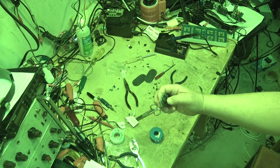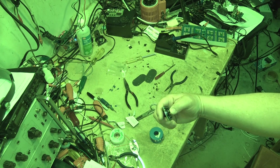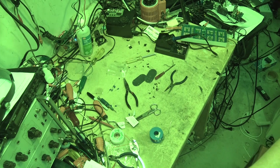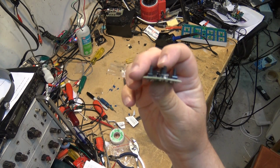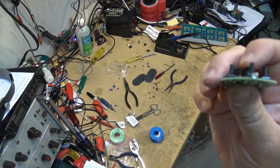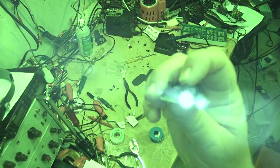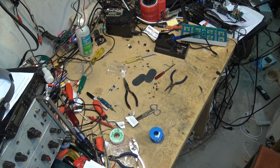So in order to test the remote control, we put the camera in night shot mode, which disables the infrared cut filter. So we can see this thing blazing like a torch. If I turn the night shot off, put the infrared cut filter back on, and then you see nothing. You'll click the button here, you'll hear it click. Now you see it, now you don't. Okay, let's try this out and see if we can set this clock.